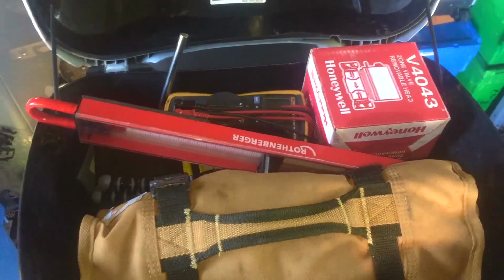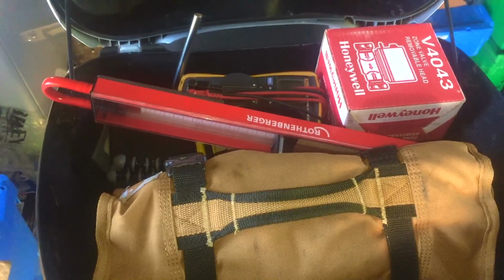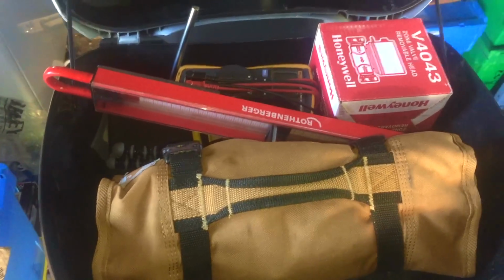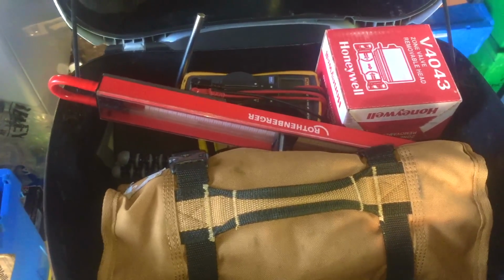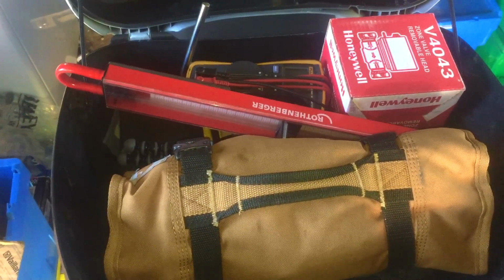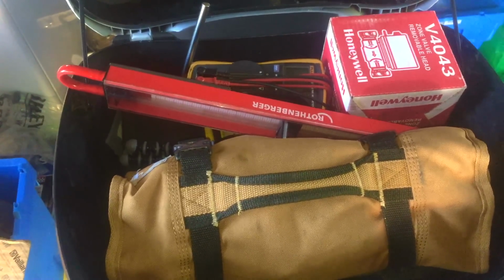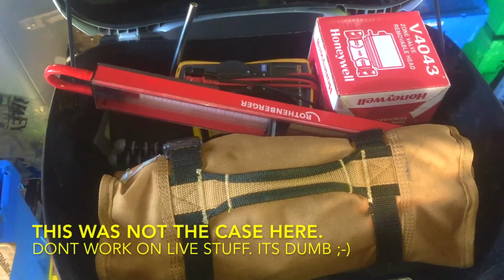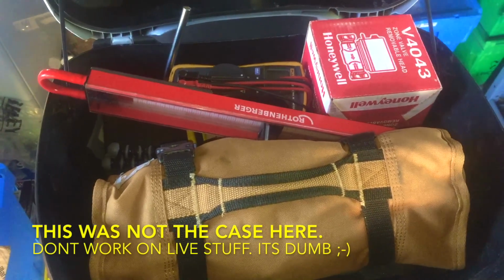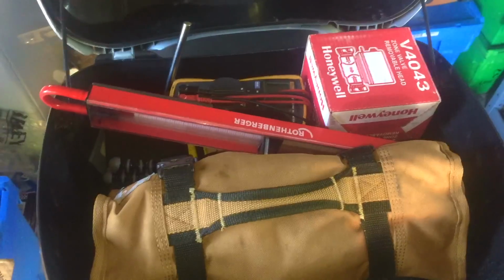So both versions of that will have a permanent live to the boiler so that it can control the pump. If something fails on that boiler, that permanent live can be applied to the pump and the switch live, so there'll be no external controls telling it to work. However, you will still get 240 volts on the orange sometimes because of that. So the only definitive test for that is to pull all the oranges out while it's in the fault condition and check it with a multimeter. That's the easy way to test it.